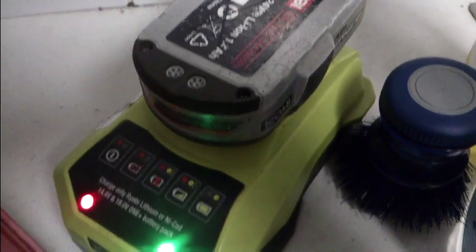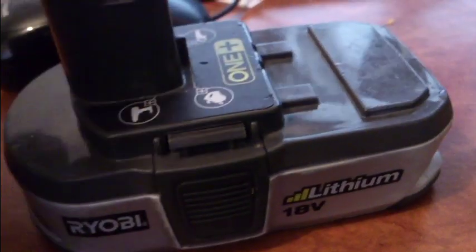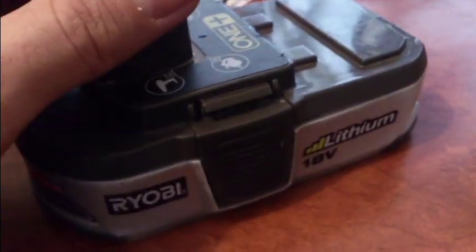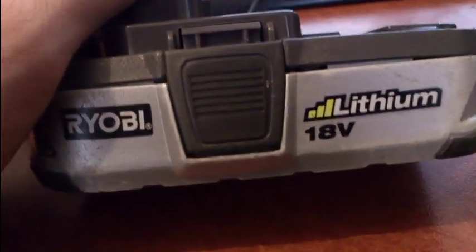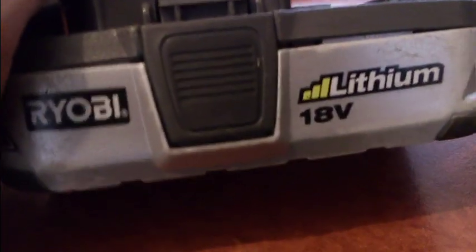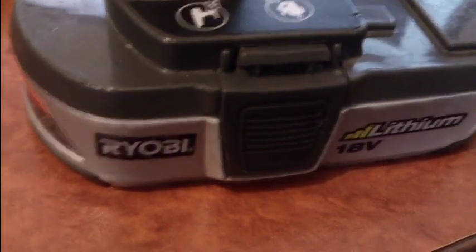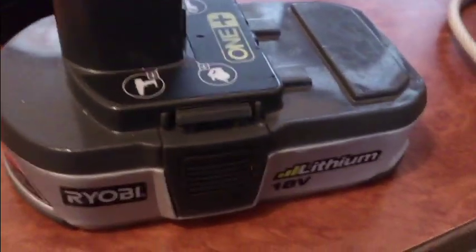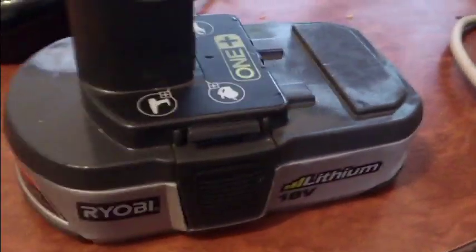Charging. Yay. Okay. We're back. I've done the mod on this. I've put the cells out of a laptop battery pack. There was an HP something or other. It still worked. A couple of the cells were a bit low. So I went through it, metered them out. All the cells were still measuring voltage, which is brilliant. So I've taken them out and fitted them into this.